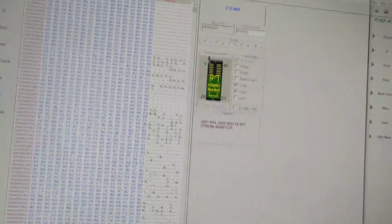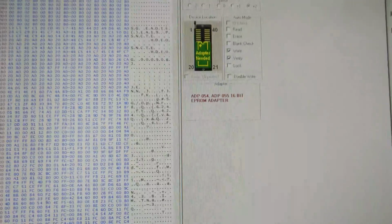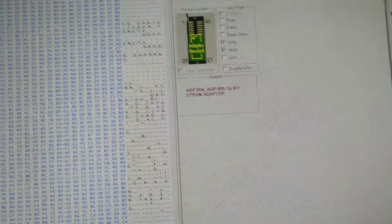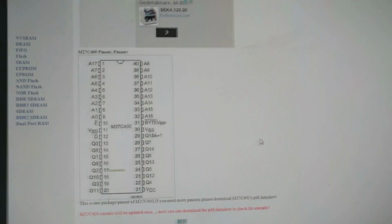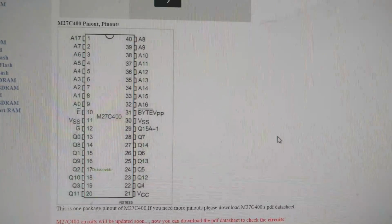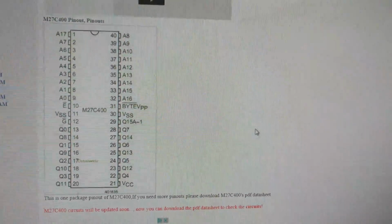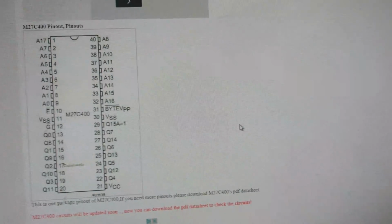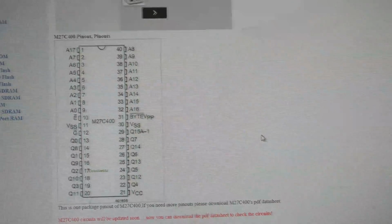And what I did was that I tried to locate the pin by shorting it to ground, and then I figured out that the correct pin was Q7, that's data line 7. And if I short it to ground, or VSS as it's represented on the chip, it's always pulled as a 0, so it doesn't output even though it should.